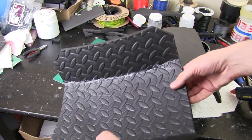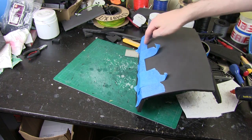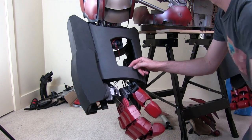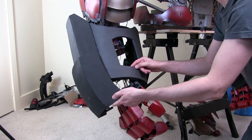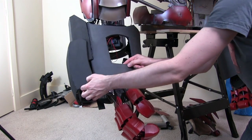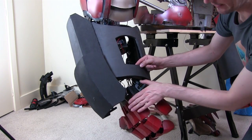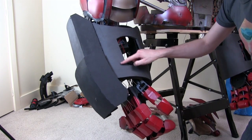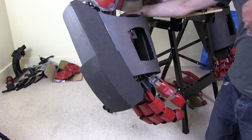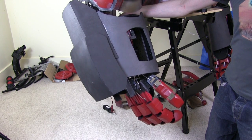I've bent this foam so it's curved in two directions by heating it and squashing it over my knees, then cut chamfers and attached the sides on using the blue tape method — going along a little bit at a time, putting glue in the seam, sticking tape on the outside, and bending it back so we get a nice clean seam line. Here they are all stuck together — we've got two sides on it and a curve all over, with curves on the side pieces to make banana shapes. I've installed those onto both cuffs and I've got quite a nice motion out of it. Quite happy with the contour there — even though this is flat, the bottom of that being curved sets it off nicely. Obviously we'll have a weapon revealed under here, and it may also pop out slightly. Here's a quick demo of it being activated by the electronics with a single press on the joystick — the weapon will fire in between opening and closing.